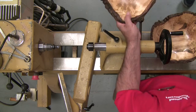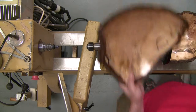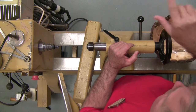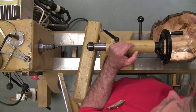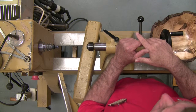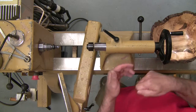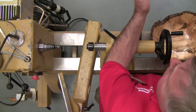How do you go about finishing the inside of the hand, taking that big block piece? Yeah, I'll mount it on my chuck, and then I'll basically drill holes around, and then I'll take a coping saw and cut that out, and then I'll come back with usually a round sanding disc on either a Dremel or a Foredom, and work it down that way. Now, I learned a very hard lesson. I'm new to having a Foredom, and I had one of those big burr circular cutters, and I stuck it down in that hole, and it twisted sideways, and I had to end up buying a new shaft for the Foredom. So I learned that's not the way to do it.